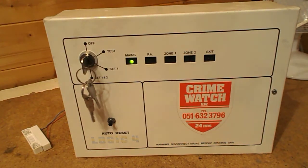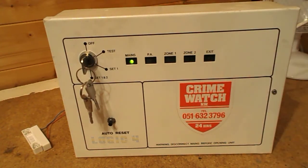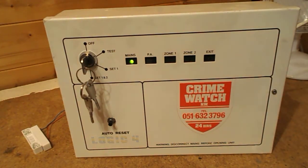The last thing I can show you — it's what the old key switch panels did. If there was a power failure, and obviously this hasn't got a backup battery in, nothing would happen. I'll turn the plug off. As we can see, the mains light has gone off, indicating there's no power to the panel. If we put it back in, unlike new coded panels with a dead backup battery where the system goes into alarm, with these old panels when power comes back on the mains light comes on and nothing happens. That's bad from an alarm company's side — intruders could tamper with power — but customers like it because the alarm won't go off at 1am during a power cut.